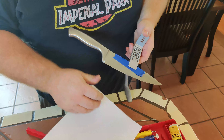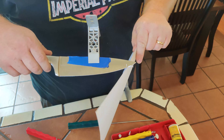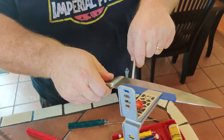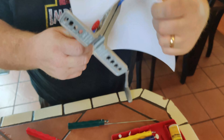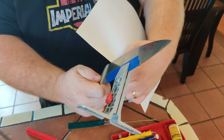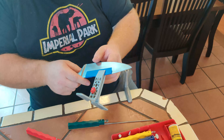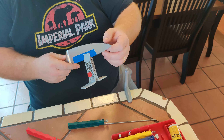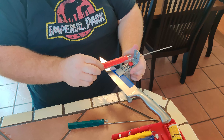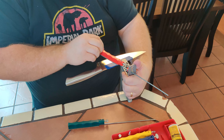Let's check the edge of this pretty quickly. I've pushed that burr now all the way over to the other side where it barely catches. You can see there's a pretty good cutting edge on there, even though it's still pretty rough. It feels dull because I haven't done the other side. One thing I wanted to point out — it's my preference to move the stone the same direction and turn my knife underneath it. That just gives me a more consistent stroke.